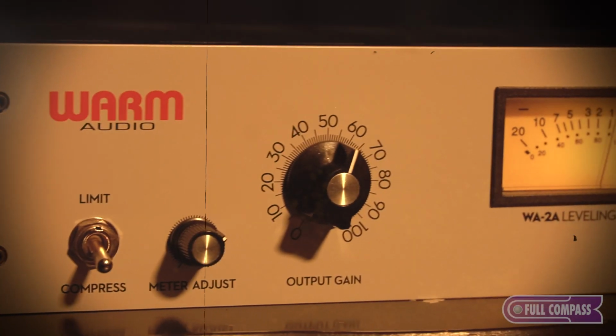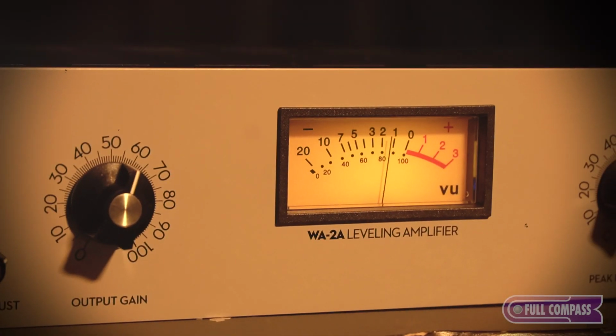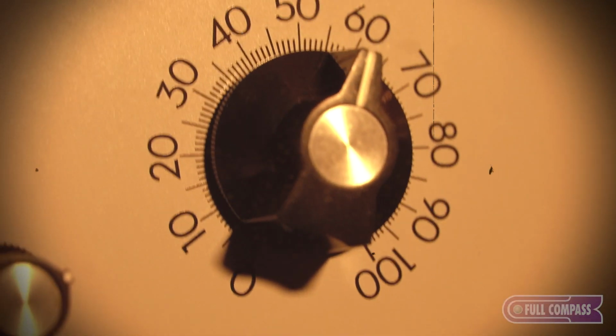It's an optical compressor, so basically there's a side chain of audio that a Kenetek T4B opto attenuator module is responding to. And then the tubes give that warmth and the makeup gain that gets output. And that warmth comes from the sourced components as well. Inside this unit are USA-made CineMag input and output transformers. And then there are premium Tungsol and Electro-Harmonix tubes that are providing that makeup gain. Warm Audio just cares so much about the components to make sure they are true recreations.